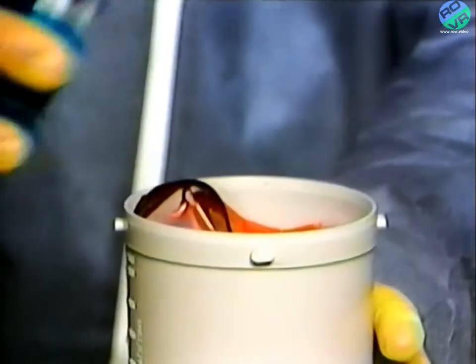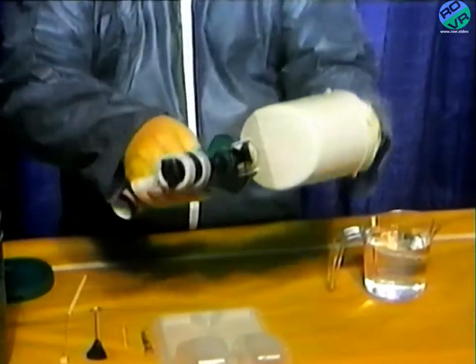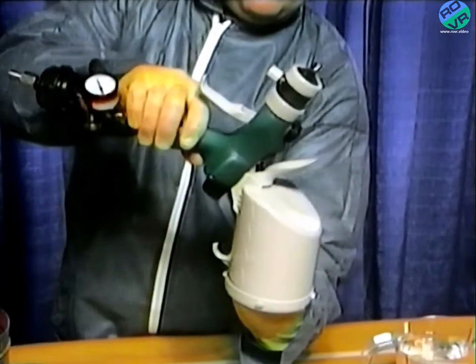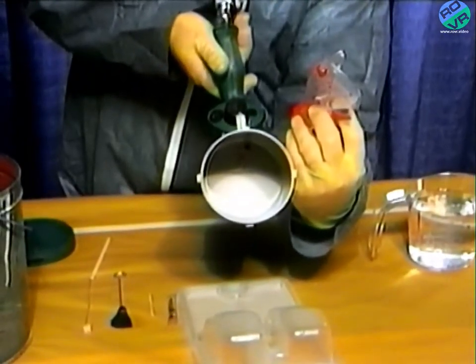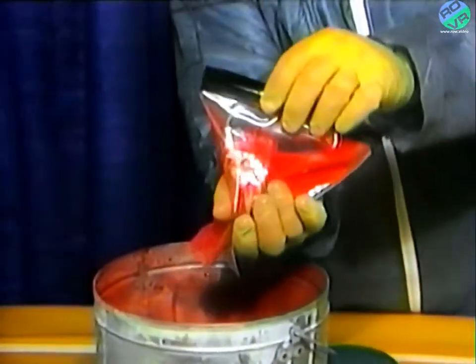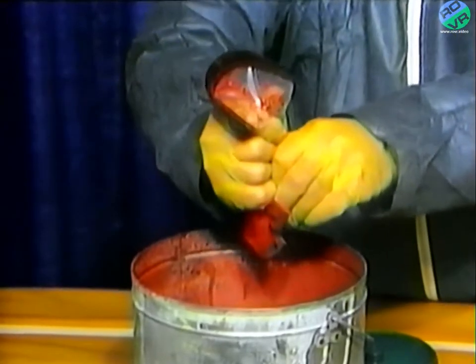Now let's talk about cleaning the gun when you're using the liner. First, disconnect the air hose, then remove the cup lid. If there is a lot of paint left in the liner, open the zipper and pour the paint out; otherwise, leave it closed. Hold the disposable liner in the cup and point the gun upwards. Pull the trigger until the paint tube is clear with no paint visible — all the paint in the fluid passages will drain into the liner. Keeping the OMX pointed upwards, carefully pull out the liner. Keep the drain bushing on top so it won't leak. Don't squeeze the liner. Now empty the paint into your waste paint container; opening the zipper will make it pour out faster. The liners are designed to be used only once — do not reuse either the liners or the bushings, and dispose of them properly.